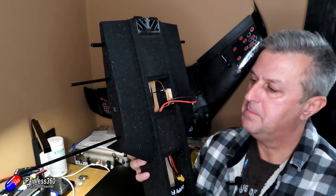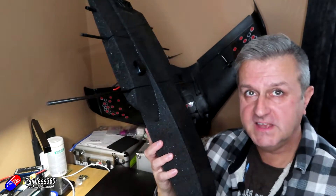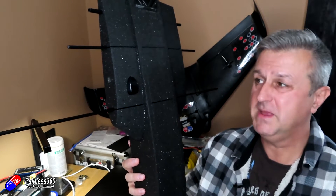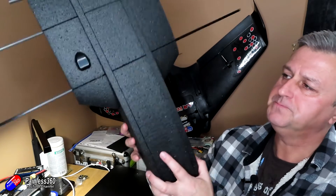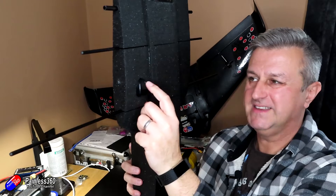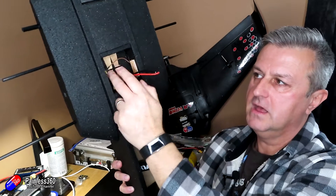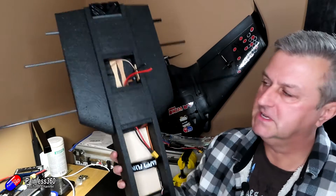Let's talk a little bit about the FPV stuff. You'll have noticed there are some extra things on here — that is my FPV antenna, something called an aeropod from Menace RC. I love these things. It sits nice and flush with the bottom of the model so hopefully it isn't going to get ripped off and damaged, and it's pointing downwards so it's going to be radiating out beautifully while flying overhead. Because I know the VTX is going to be over here, I've run the 15 centimetre cable through the slot designed for cable runs, with a couple of relief cuts to make sure the cable doesn't have any very tight radii, which is bad for coax cable.